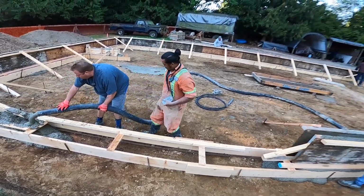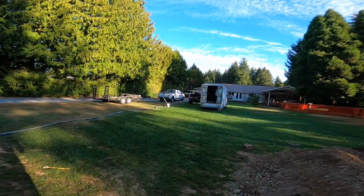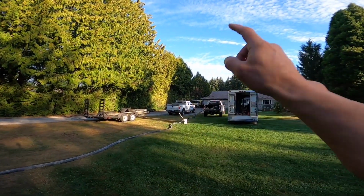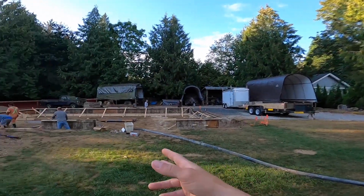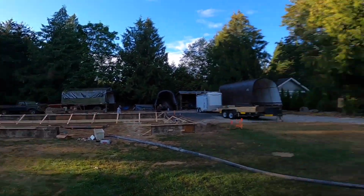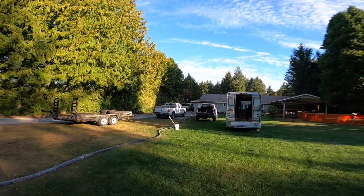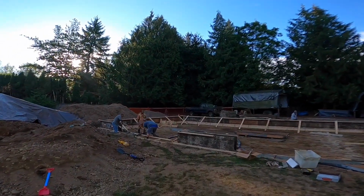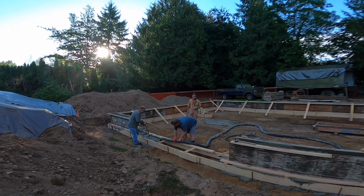Yeah. We don't want to get into pumping the hopper right down and pushing a bunch of air into the system. Reason for that is if we have a bunch of air in the system already, once we put our sponge in and add our air compressor behind the sponge, you're not going to get a steady flow of concrete. You're going to get concrete with little air pockets spitting out, uncontrolled air pockets spitting out. So do not run your hopper down to the point where it's sucking air and pushing into the lines before breaking off to blow the lines out. That's a critical thing. We should see that wet stuff come through here pretty soon.